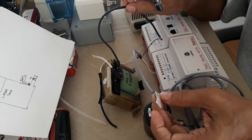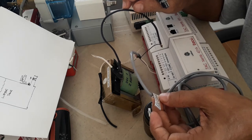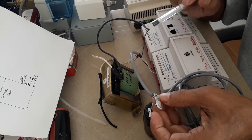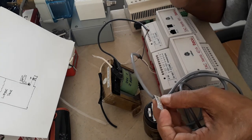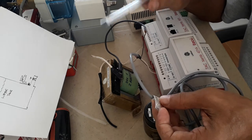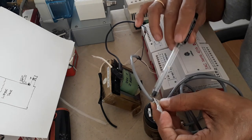When providing power supply to this type of field device, you also need to include safety devices like a fuse. Use a fuse holder, and before supplying power to the differential pressure transducer it should pass through a fuse — maybe a 2 or 3 ampere fuse.